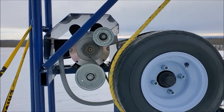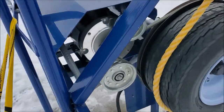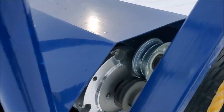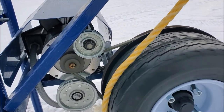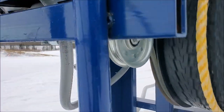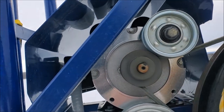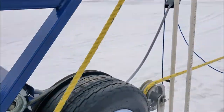The one problem we had was running the straight belt from the outer pulley to the inner pulley — it would slip on the pinion pulley and the rope would stop. So as you can see, I put these two other pulleys on the top and bottom. The top pulley is mounted right into the motor casing using bearings and a bolt with a shorter thread length. The bottom pulley is an adjustable pulley from a farm shop, bolted so you can slide it back and forth to tighten the belt's resistance around the pinion. That prevented slipping — we can pull as much weight as we want now, and the motor will stop before it slips.